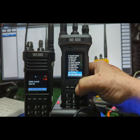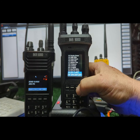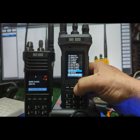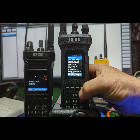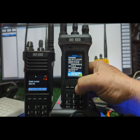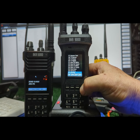If you have a hand mic with LEDs you can turn those on. You can check radio info. System test has some cool stuff for techie guys. TX secure — most of these things I will not enable on a regular user radio. I like to have full control. In my zones I allow editing of NACs and tones. I do have vote scan in this — I haven't tested it yet. We're on firmware 6.5.10.18, which was just posted a day or two ago.